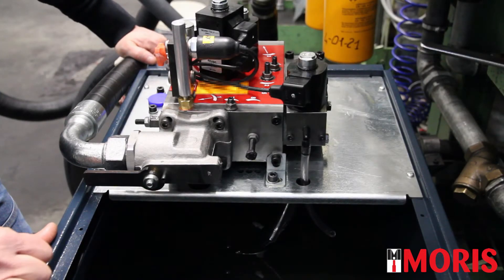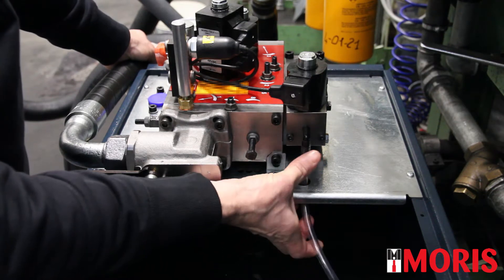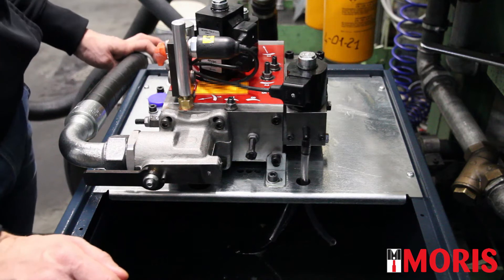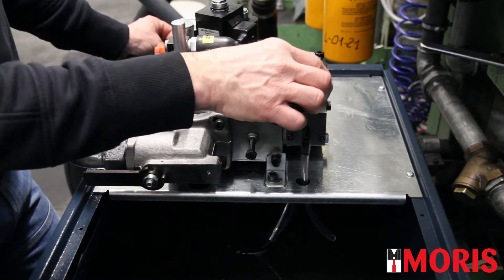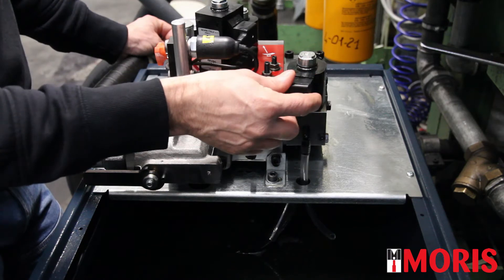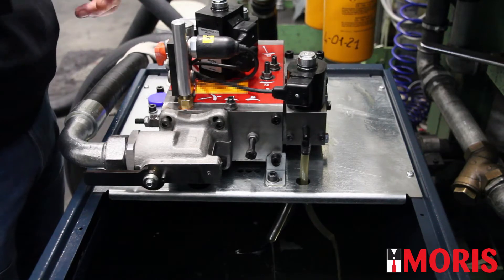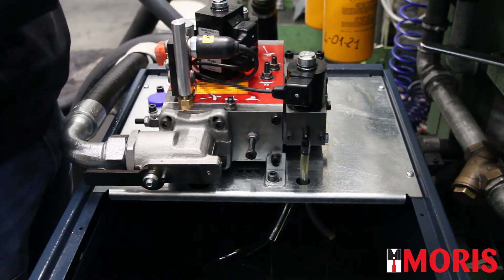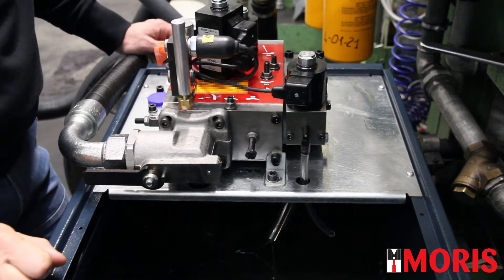Repair sequence R3A: oil leakage from the discharge hose of the star delta starting valve. If during an up travel oil is continuously coming out from the hose, then the problem is the electrovalve. First of all, check that the electrovalve is magnetized — for example, with an Allen key, you can see if there is a magnetic attraction. If the electrovalve is magnetized, then there is a problem inside the electrovalve.